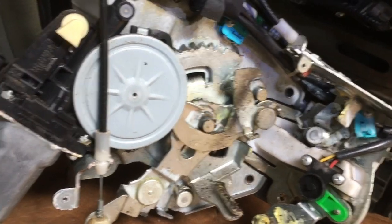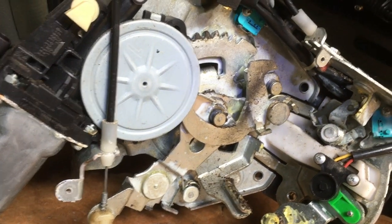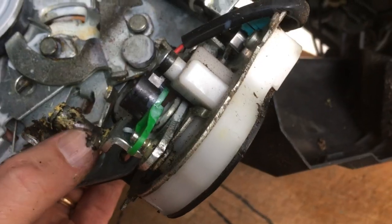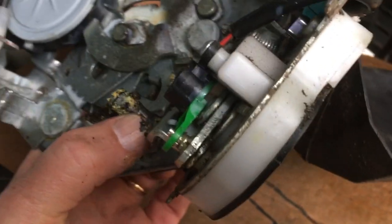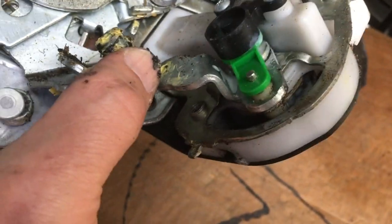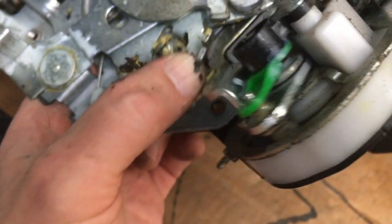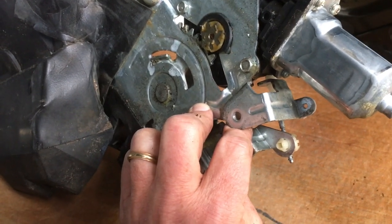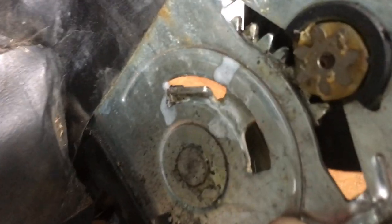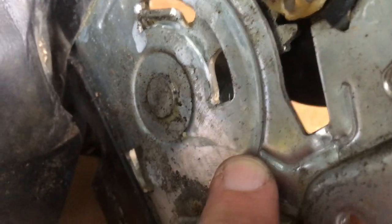I'll get as many more pieces lubricated as I can and then we'll put it back together and see what happens. There are many parts that become accessible as soon as you rotate something, so be sure and turn it all around in different directions and move things — you will suddenly see more springs and pivot points that need lubrication. Even looking at the back side exposes some pivot points down in here where you can shoot some lubricant and it will go between the two metal plates.